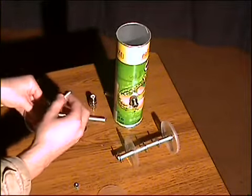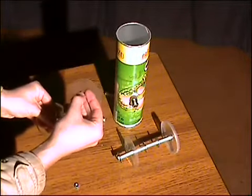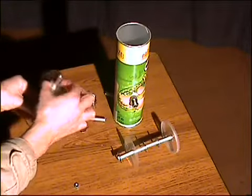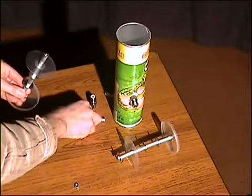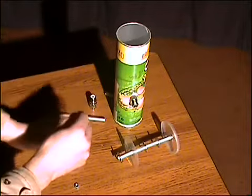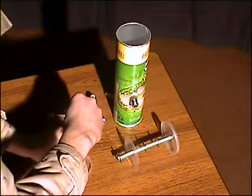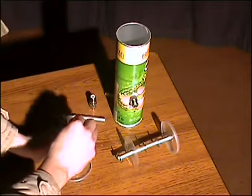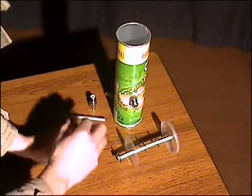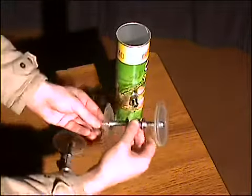Now when you get down to your last piece of tubing and your last washer, we then want to stick the plastic disc over the all thread, that you've made another hole in, and put on the final washer, final piece of tubing, the last washer, and then sandwich that in with the last lock nut. I'll leave that off for a minute. But you've constructed your front collector.